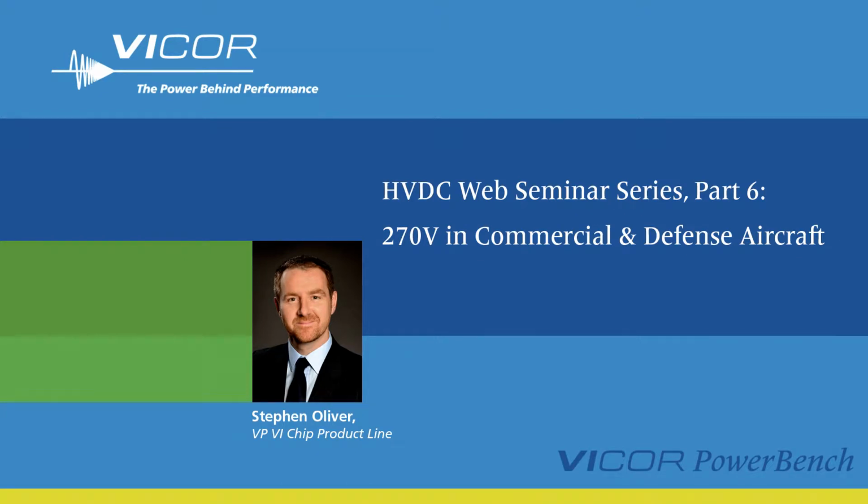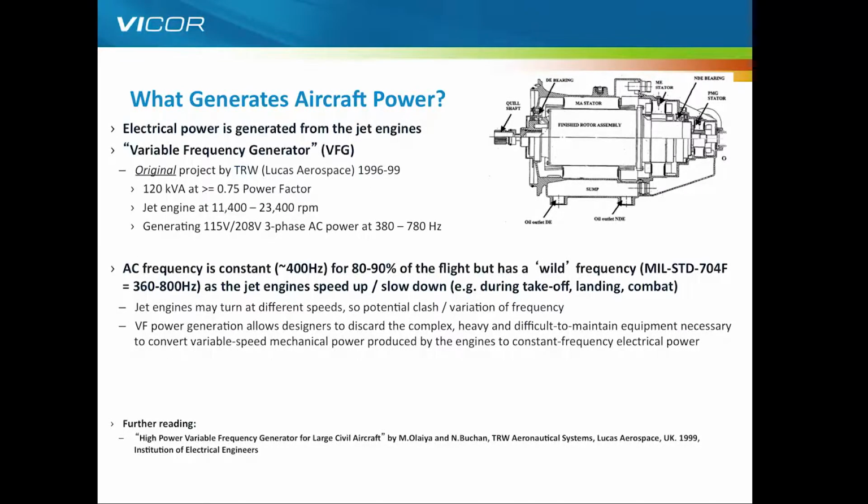So when we look at 270 volts DC, we first of all have to ask the question, well, where does electrical power come from on an airplane? And the answer is it comes from the engine and is then generated. So whether it's a turboprop or a jet engine, we have a mechanical rotational force that goes into a generator, and an AC waveform is created. Now, originally in the past, that was a mechanical linkage, and there was a mechanical system which maintained a 400 hertz output, which is why the original aircraft specs, going back to the MIL standards, was 400 hertz. However, that mechanical linkage meant that there was quite a drag on the engine itself, and so it was very inefficient to generate electricity in this way.